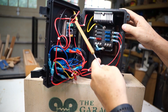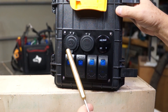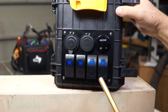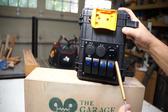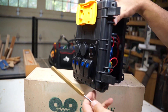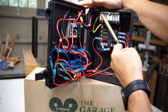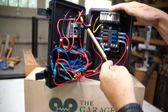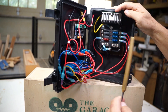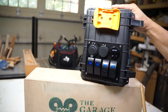Connected to this, we split off the wire to the voltage meter. Typically, how you'd use this panel is you'd get your 12 volts from a boat battery coming into the system, and from there you could check your battery voltage and monitor it as you use it. But for this system, I don't want to monitor the 12 volts — that's going to be constant and won't tell me anything. I wanted to see what the tool battery voltage is doing the whole time. So I wired the voltmeter in before it goes in line with the buck converter — that tells me the battery voltage. But it's after the low voltage disconnect, so if that cuts off, everything cuts off. That was important so whoever is using it can monitor the battery voltage and know when to switch the battery.